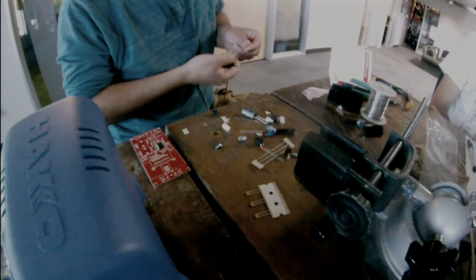That's it for now. Okay, so as we were saying, look, the wax cylinder was pretty lo-fi. They decided somewhere, I guess in the 30s, that there were some things they could do about the fidelity. A lot of the noise, the high-frequency, grainy, scratchy kind of sound, is due to the properties of the material. The wax cylinder, they were using shellac at one time, or nowadays they use vinyl, all of which are a little bit gritty. Yeah, it would chip when you tried to cut it, and that would sound like high frequencies.